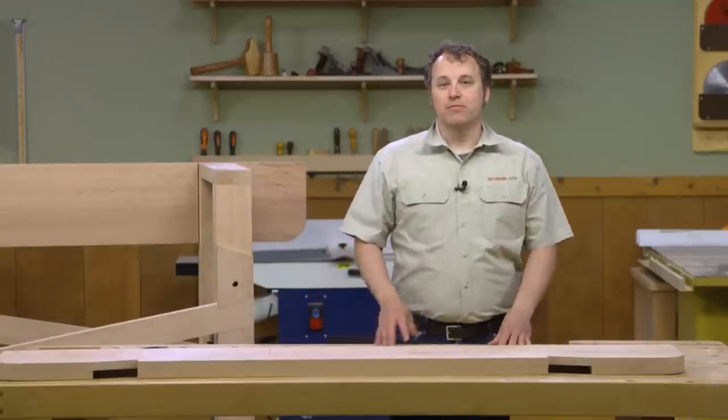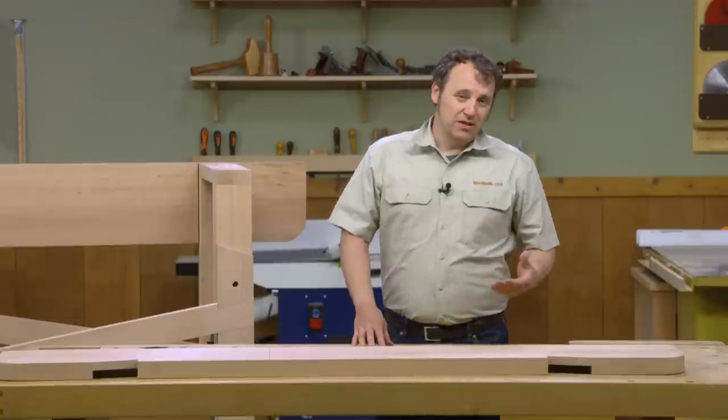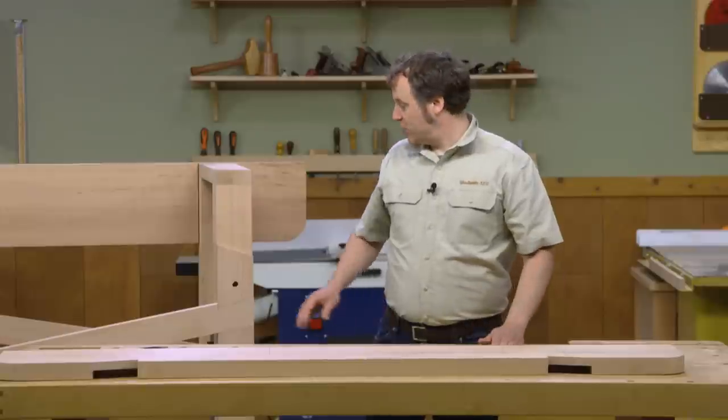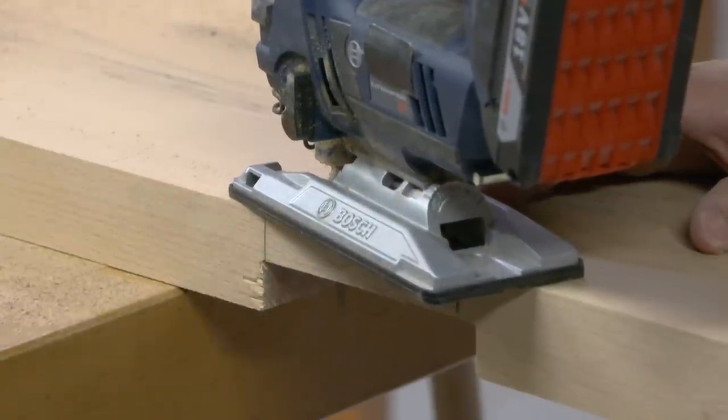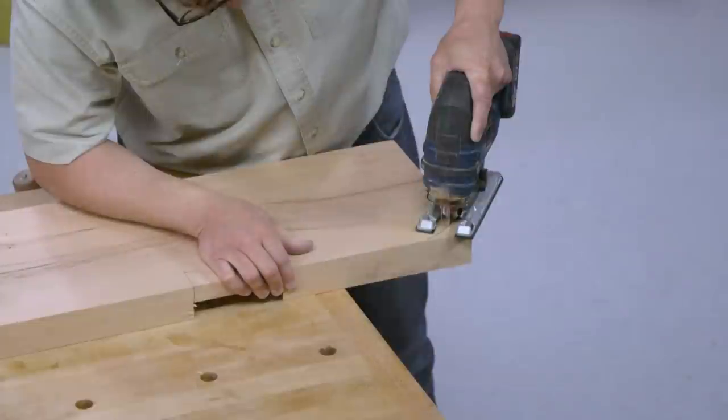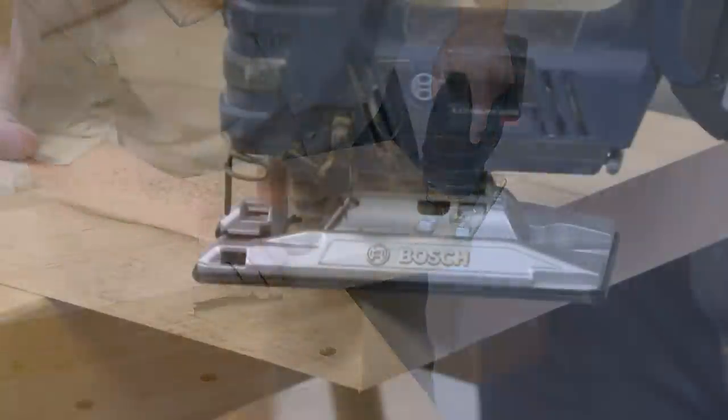After plowing out those dados on the backside of the aprons and clearing away the chips, there's still a little more work to do. The first is to cut a peak on the lower edge of the aprons where it matches up with that same peak on the legs. I cut the long diagonal with the jigsaw and then the straight shoulder with the handsaw. It's just a matter of fine-tuning, setting the apron in place until you get a nice seamless fit. Then use a jigsaw to cut a radius on the lower edge of the aprons — a bit of comfort so that when you bump into the end of your bench, it's not sharp by your thigh.